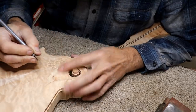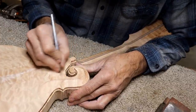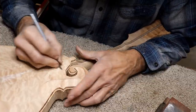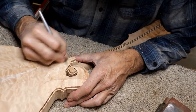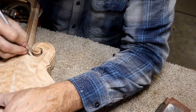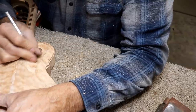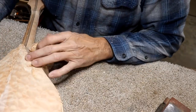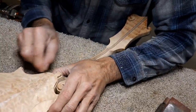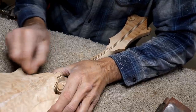It's even cutting this really hard wood. I was having trouble getting in there and getting this to work. You can sand this, but the problem is it takes forever. If you can get it pretty darn smooth with a scraper, then the sanding is still a lot, but it's a whole lot less. This is really working well. I'm glad I tried that. That's exponentially better. I'm going to keep doing that. At least now I know how to improve the X-Acto blade as a scraper. It's so much better.